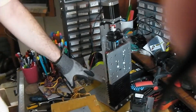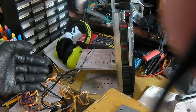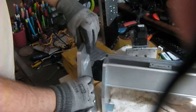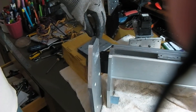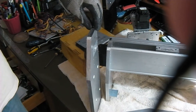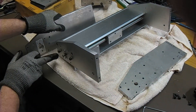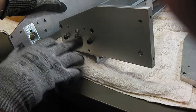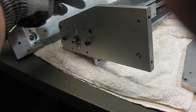Better rails rather than just steel bar, so much better as far as movement goes. The back plates have multiple mounting holes — we found the inner holes are the right choice, which should give about 10mm clearance between that and the gantry when loaded on. The stepper motor here is going to come off and this replacement part will go on, giving about 100mm of additional height, so rotary axes can fit underneath. In here we have two M5 bolts which hold the skate bearing at the end of the lead screw.